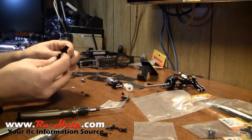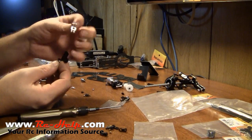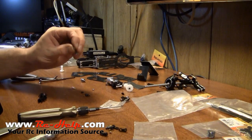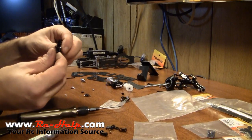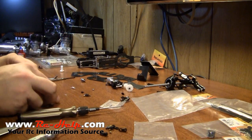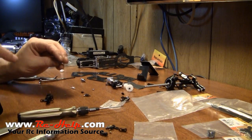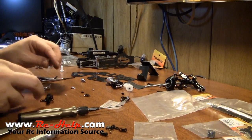Now what we need to do is get our tail and put the grips back on to the slider. Now when you do this, make sure that the little brass sleeves are actually longer than this plastic piece is wide. The reason is, when you tighten that screw down, you want it to pinch the brass, not the plastic. That's what allows it to move.